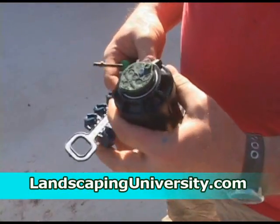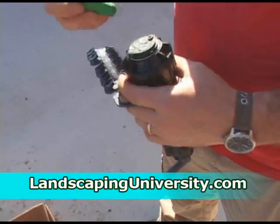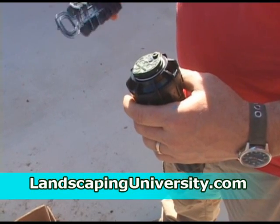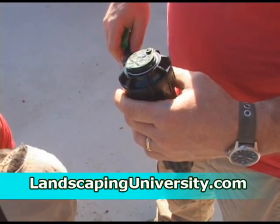You'll put some at 3.0 or 4.0 depending on the range of openness you have. Use 2.0 for 90 to 180 degrees, 3.0 for three-quarters of a circle, and 4.0 for 360 degrees.